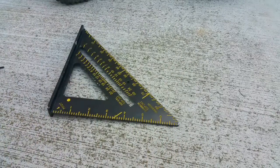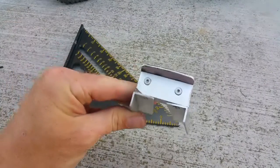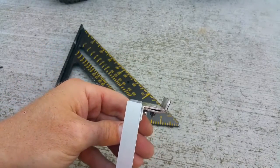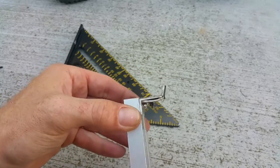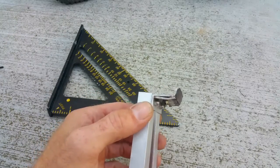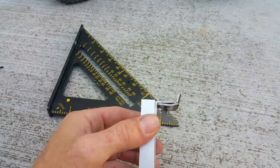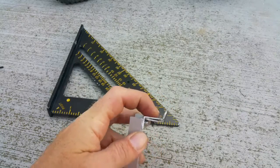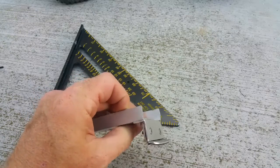Once you cut your four pieces of sheet metal, all you need to do is cut the holes so the screws can align and bolt together. The only really complicated part on this base — I used a torch and a wooden block. I heated up this metal to give it a slight angle right here to open the angle, and I just eyeballed it.